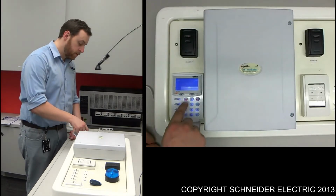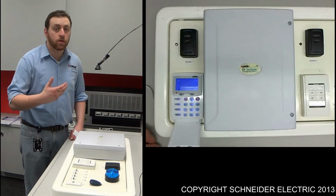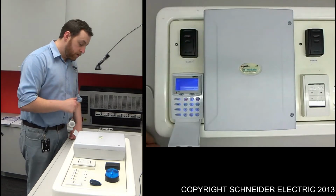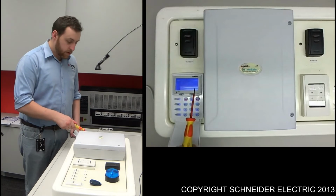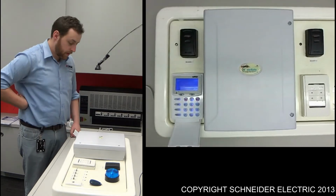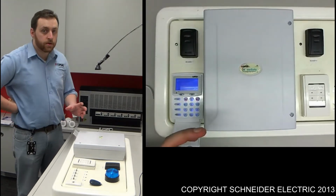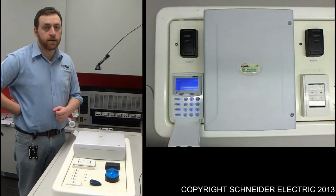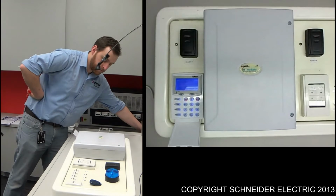So if you press P123E, like I said, that's going to depend on how your system's been programmed in the first place. What you should find is the program icon should be illuminated down the bottom here. That, like I said before, is going to prevent the security system from alarming itself when you take the covers off. The next thing you need to do from here is down power the system.